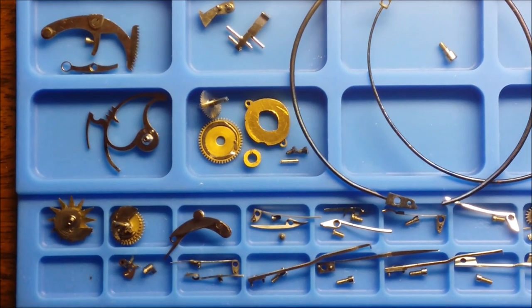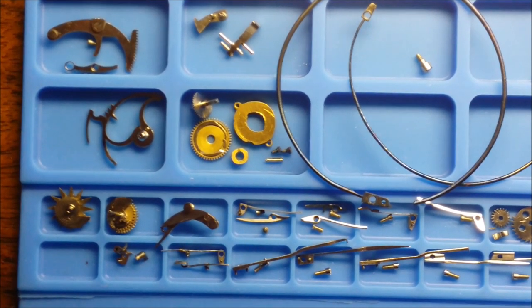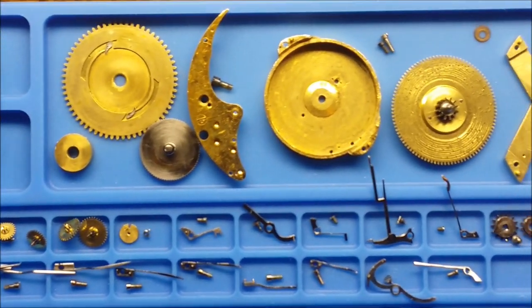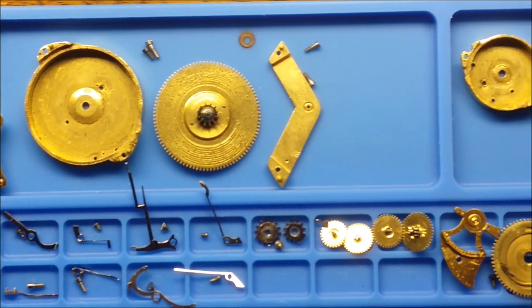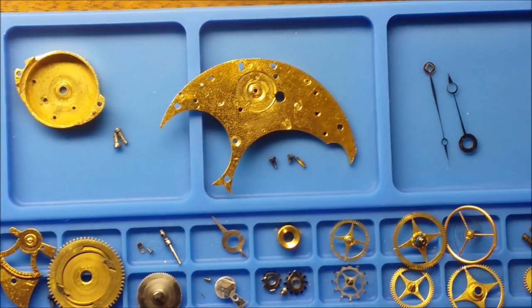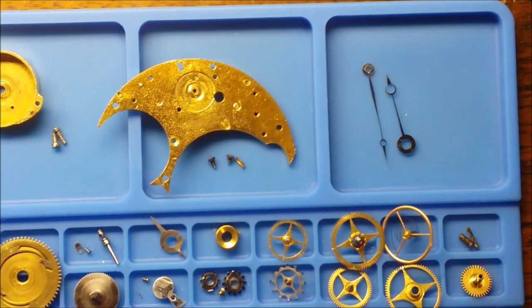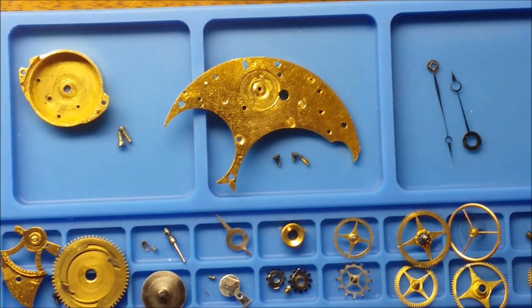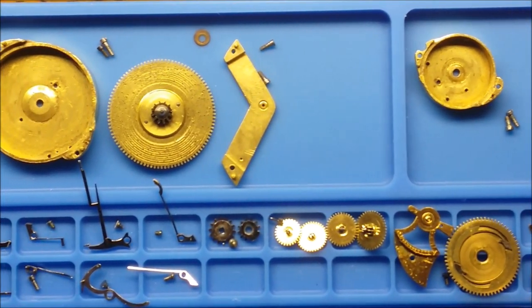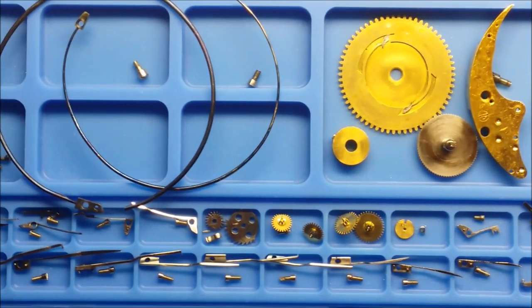We have a situation where all the parts are laid out. I really strongly recommend laying out parts like this and either videoing or taking pictures of the parts laid out. On a watch this complex, I didn't wash the screws. With so many parts it is important that the appropriate part be matched with its matching screw. When you have this photographic reference, after you reduce the parts to a basket for cleaning, once they're cleaned you can lay them back in their place with their appropriate screw. That is very important with a piece as complex as this.